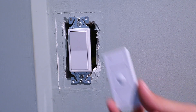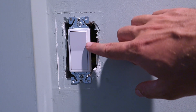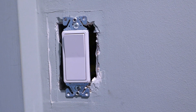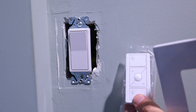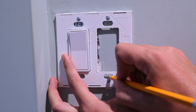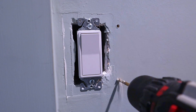So this is where installing this second switch is pretty cool. I've got one box here with a light switch in it, and this light switch is a three-way switch that controls the lights in the kitchen. So I also want to be able to install this second switch right next to it. That's going to complete our three-way switch installation. In most cases where you'd have to run wiring, you'd also have to cut this out for a double box. This is what the second switch mounts into, and then the cover will go over the top. So I'm going to put this cover piece on there so that I know where I'm going to be putting my holes for that clear piece. Now I'm going to take my drill and drill out my pilot holes in order to mount that plastic piece to the wall.